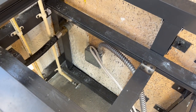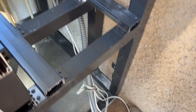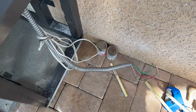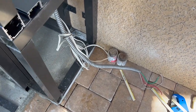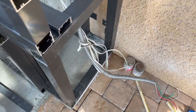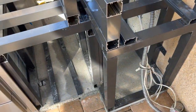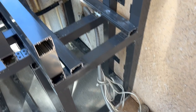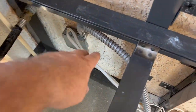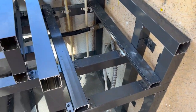There's the 110 supply coming in. I don't think anything is switched there — it's just a supply line. One of these went over to the refrigerator, one went to an outlet, and one supplied the light — that light and the lights all the way around the pool cage. I don't need all of those, and I'm going to redo them anyway with all-metal conduit. But that'll be next — it's coming along.